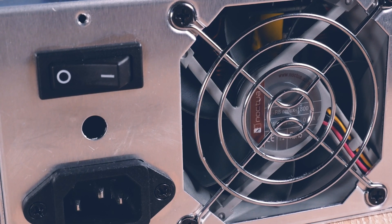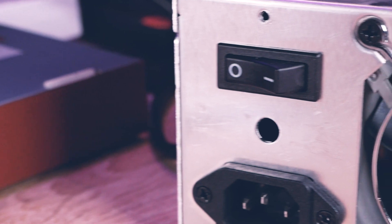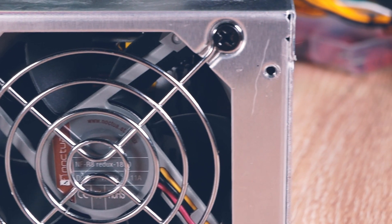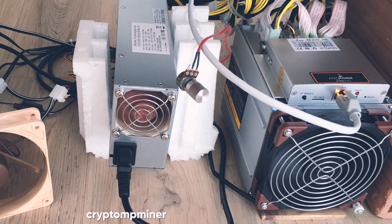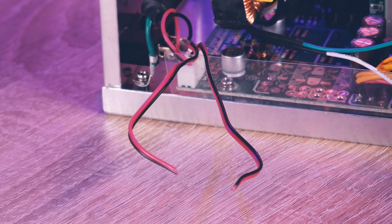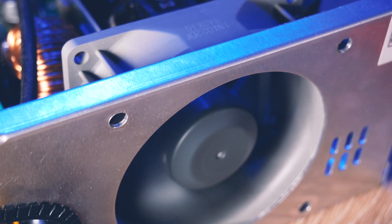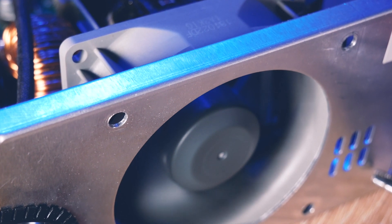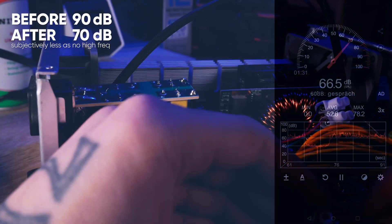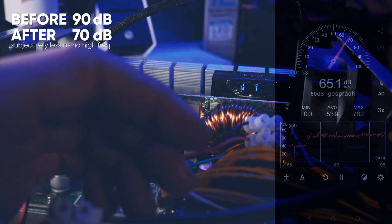I would recommend checking your particular PSU first before purchasing anything for a mod like that, as they vary greatly. It should still be somehow possible with most types of PSUs, but sometimes you can have bad luck and everything is simply glued shut. Also in cases like the Bitmain APW or some other PSUs, the fan cables are not the normal PC standard, so you have to figure out which cable does what and cannot simply operate by colors. Still, if this video gave you some inspiration or ideas for your own operation, I'm glad. That's it - classical silent mod by slapping a Noctua in it. Please subscribe for weekly tech and mining content - all the best, happy mining and bye.